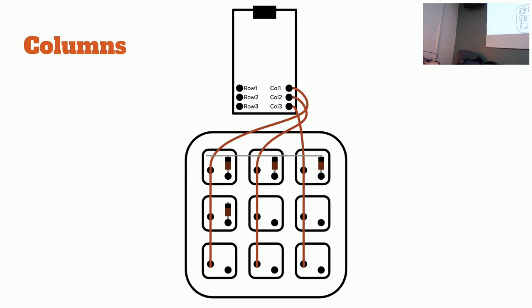Now, one thing that might help is you can try cutting it with the wire stripper. Cut through the insulation, maybe wiggle it, get a little bit of a gap, and then apply the heat. That may cause the insulation to draw away. Oh, right? Okay. It may just shrink away. It's at least a place to get started. Up to you. Those are going to be riskier because you might cut through the wire. But you could also just lift this up, right? Oh, yeah. So lift it up and then just cut right there. Okay.